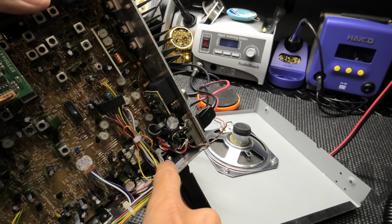Power at 1 watt is going to give us... Yeah, see, we can bring our dead key up a little bit. So you want this thing dead key in about probably about 10 watts or so we could let it dead key. So there's 10 watts. Okay, and what does that give us for... So I turn the amp off. And that comes out to looks like not even 2 watts, so 1.5.